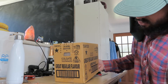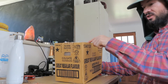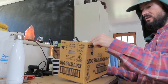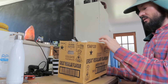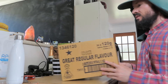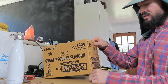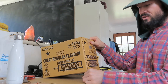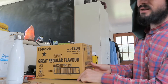The friction of moving the container from one side is so much greater than if you have it only on that corner — the jack. Then there is this single point where it tilts, and just the slightest instability is going to tip it. But if both sides are on the ground, then it's fairly stable. That's the reason why a lot of people trying to jack up their containers find the jack winds up tipping, especially if there is soft ground. But if there is a jack on both sides, the stability from back there is probably enough to prevent that.